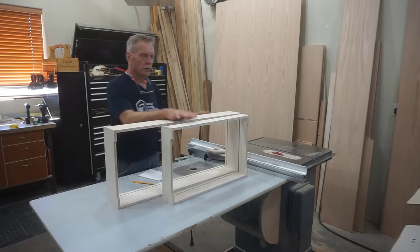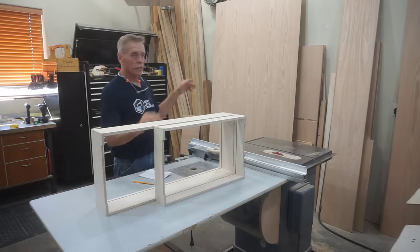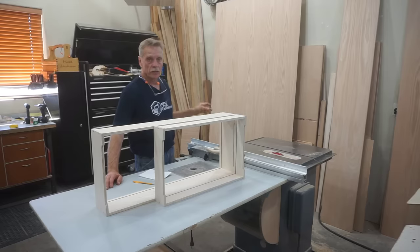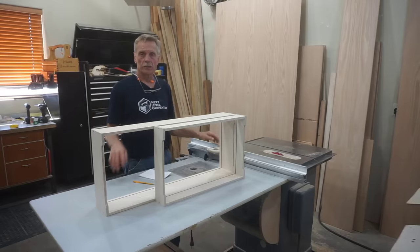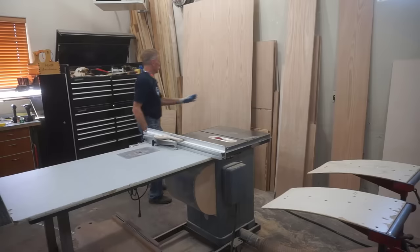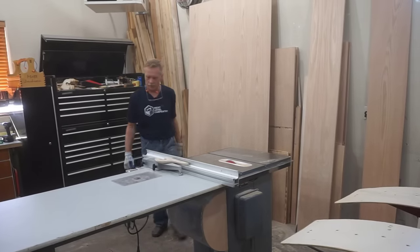So using the same protocol for sizing big sheets into small ones that I use for the drawer boxes, I'll do that on the rips for the bottoms. I'll make 3 rips, 14 7/16, and then cut them to appropriate length, making the final pass on all the sides at the same time so that the drawer bottoms are consistent. And I'm starting with a 33 inch wide rip for one of the bottoms here. I'll get the other strip off of this side.